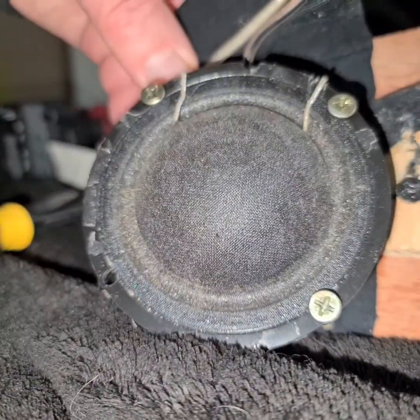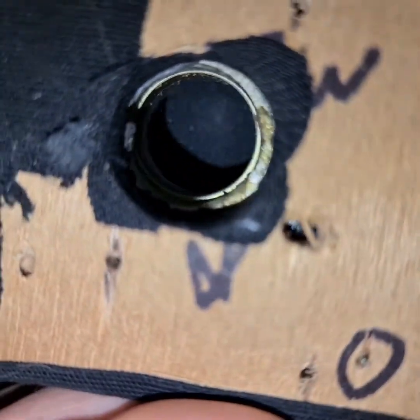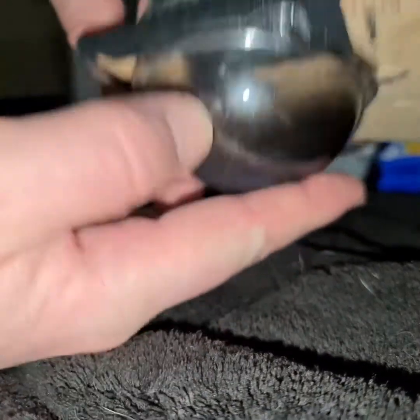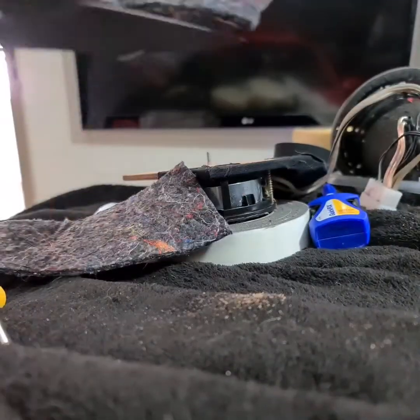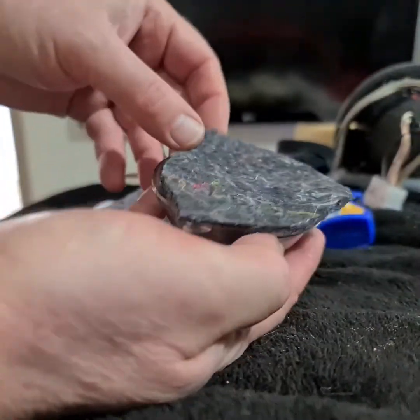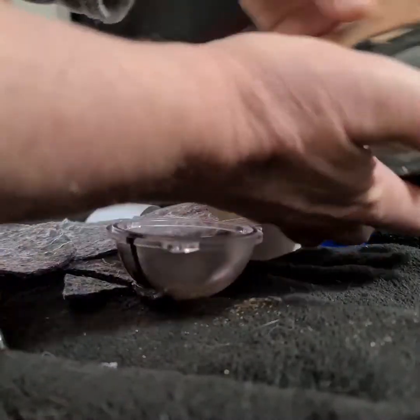So here I'm lining up the driver on the board, just checking the clearance and have the holes match up. And now we just test placing the cup. There is a bit of an offset here, but I think the asymmetry would be of some benefit than just pure symmetry, just due to less convex kind of reflections in that shape of the dome I picked. And there's also a limited amount of space behind the board in the sail area where it's mounted.